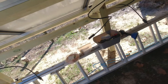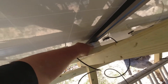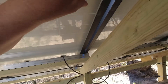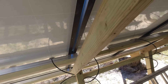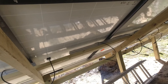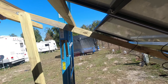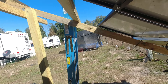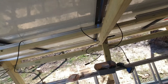I'll have a little left over. This is all redundant anyway because all these solar panels are already tightened down with the clamps, and we're connecting every solar panel — but I might just put those on since I have the wire. The 24-foot run plus about four feet across is 29 feet, then eight or six-and-a-half feet down, so roughly 35 feet of wire total. Don't make the mistake of only getting 25 feet — make sure to account for going up, around, down, and over.